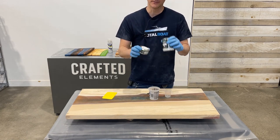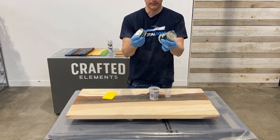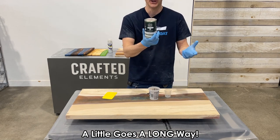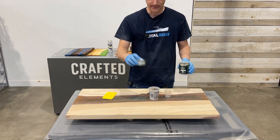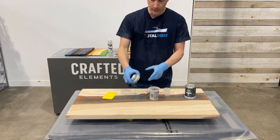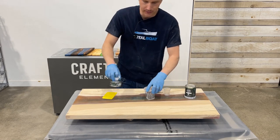I'm going to measure out a 3-to-1 ratio — 10 ml of accelerator and 30 ml of the main component. Be careful not to spill any on the tabletop in advance. This much is probably way too much for this tabletop — we'll likely waste some. The cool thing is if you mess up the ratio and don't put in enough accelerator, it will still dry, just take longer. It's not like epoxy resin where it will never set if you get the ratio wrong. But obviously you want to be careful with the measurements, since there's no point in waiting longer than necessary.